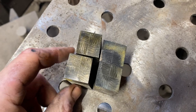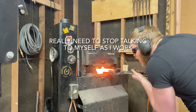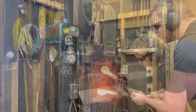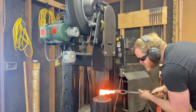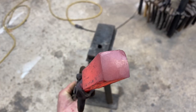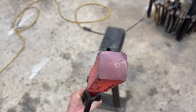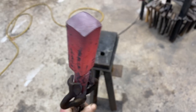It's looking pretty good, so we'll orient everything so the clean sides are touching and forge weld this again. It's been quite a while since I've been that unconfident going into a forge weld. There was serious gapping and I had to grind off quite a bit of delamination on the end before I thought we might have good material. I'm going to keep it at welding heat when I draw it out, just to hopefully close up any gaps.